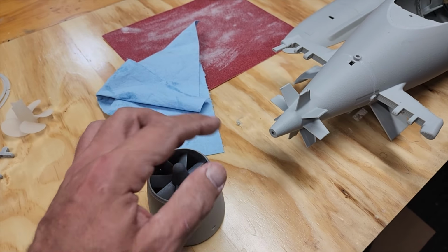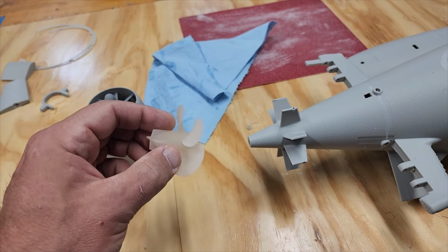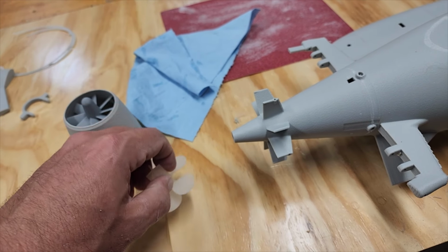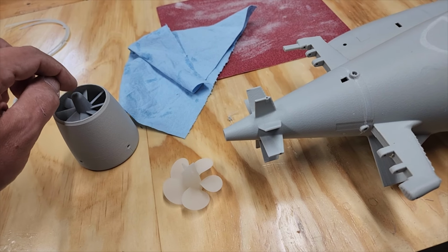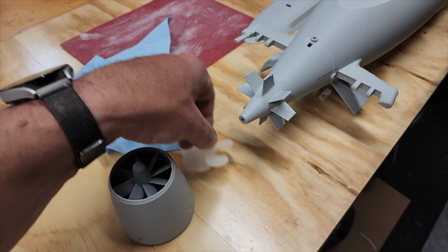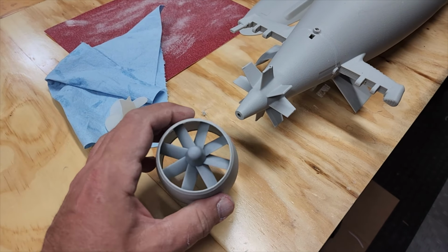What I'm going to do inside this area here, which is completely open, I'm going to put in a big five-bladed propeller. Now this is an alpha prop, obviously, but I'm going to cut it off. And we're going to mount it inside, so we need to remove whatever the hub thickness is from this area, and then just mount our bushing and everything, and then this should mate up to the impeller there, or the stator, sorry. And then we'll have a shrouded prop. And this is a contra-rotating prop, and this is a clockwise correcting stator.